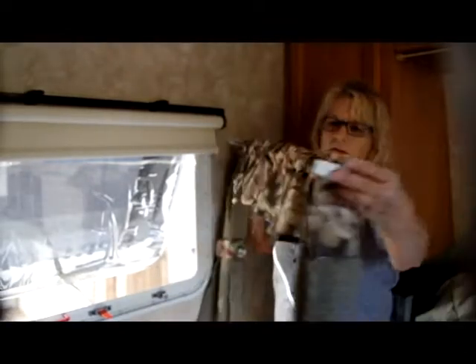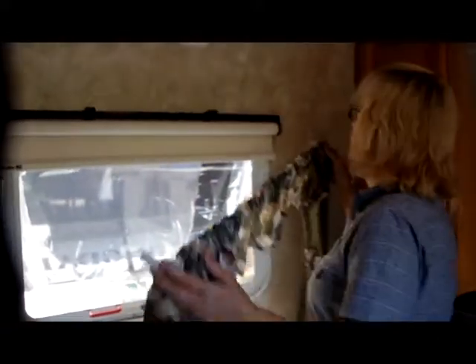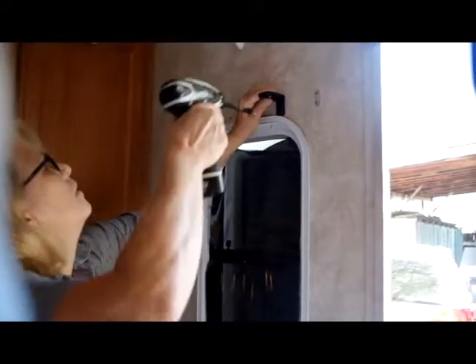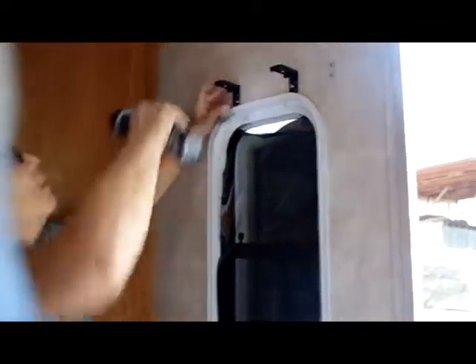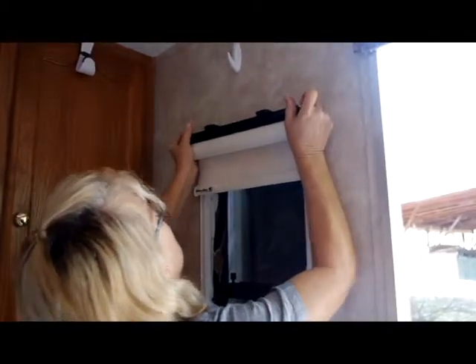This is a window that has the little drapery hardware, so what I do is put an L-bracket — these are number four L-brackets. I use the same screws that they had in there for their other brackets for the mini blinds, then I put this back on and find the screw hole to put this bracket in. You really only need one screw because it's just a little baby blind. You notice the teeth are up front — I'm going to take my blind and put my teeth in.